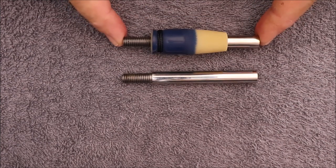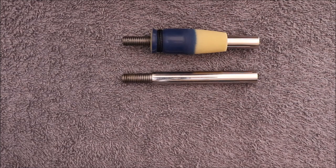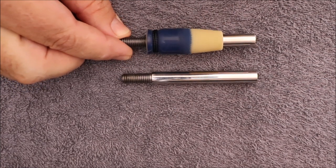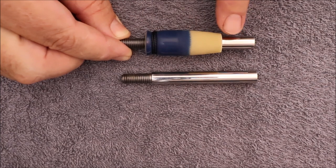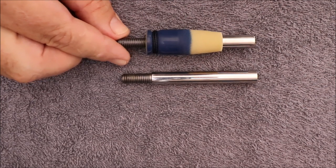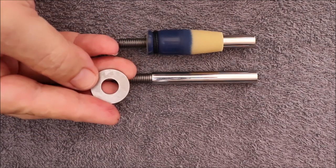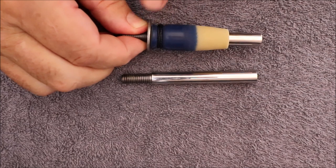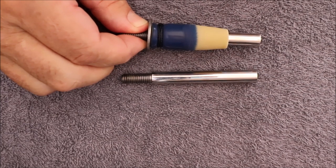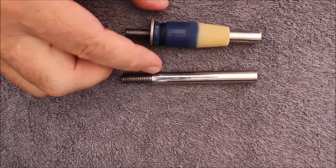To control the depth there's a tube with a rubber stopper on it — just a piece of speargun rubber tied off to stop it going any further. And this can vary to control the sample size. Both these will be stopped by a washer, which stops the rubber sliding back.